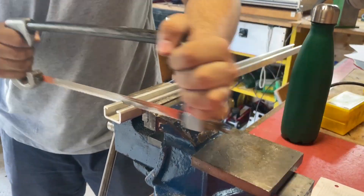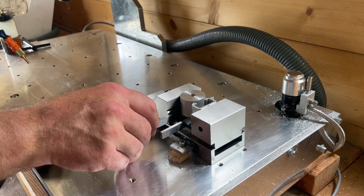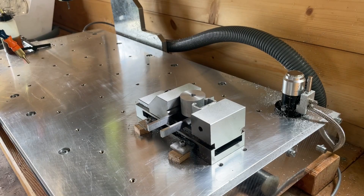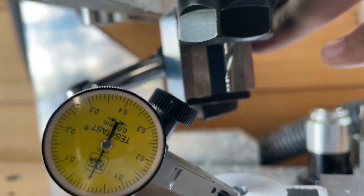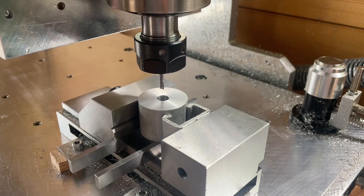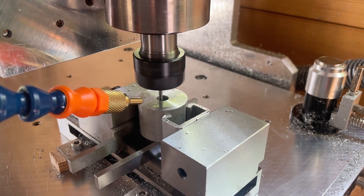I use this prism to press the part into the accurate prism in the vice — there's a small prism on one side and I put this part on the other side so there's a bigger surface area holding it securely. Then I aligned the cylinder with the spindle of my CNC using a dial indicator, moving the X and Y axes until both read zero. I used a piece of paper to zero the Z axis.